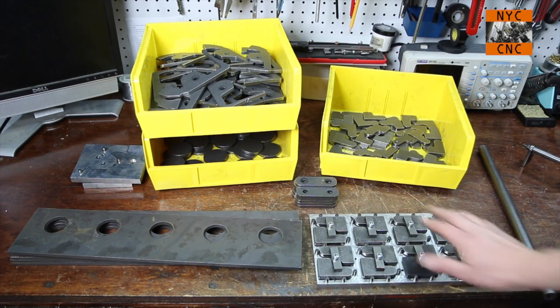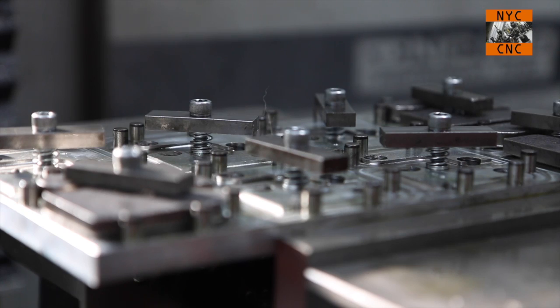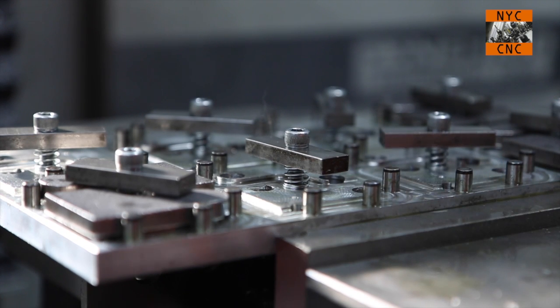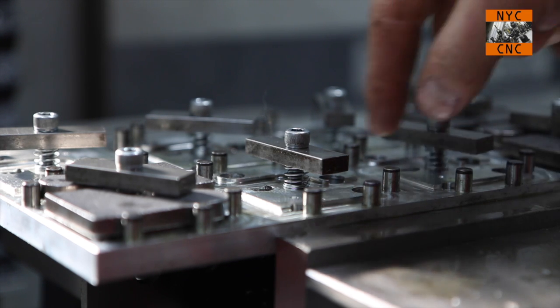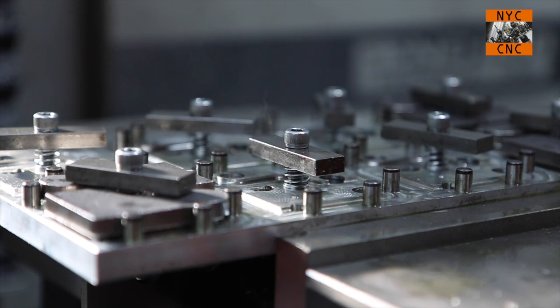Before I weld these on, we'll machine this bar — this is 3/4" OD, 3/8" ID bar. We'll machine them down to about one inch chunks with a little set screw hole in them, and those are to hold the feet. The way I hold those in place: I use this piece and just tap it down — the workpiece slides over this bar and it honestly doesn't move on you, which keeps it perpendicular, obviously important since it serves as the ground stake for the target itself. Just tack it on both sides and we're making progress. I put a little spring in between the fixture and the clamp — when you loosen the clamp it holds itself up and makes it much easier and quicker to load and unload the parts.